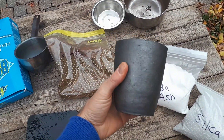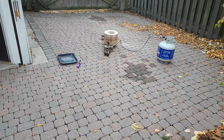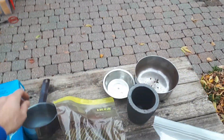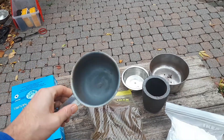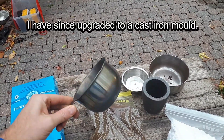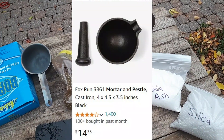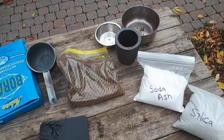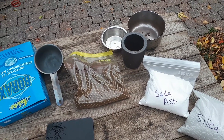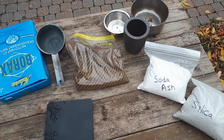This is a new clay graphite crucible. I'll toss it in the kiln for maybe 15–20 minutes and see how long it takes to melt, then pour it off into the mold I made. I'll also add 25 grams of lead as a collector metal, which should collect any precious metals or other base metals in the roasted ore.